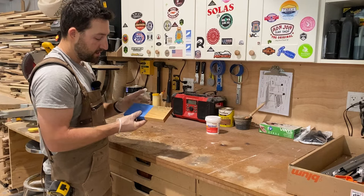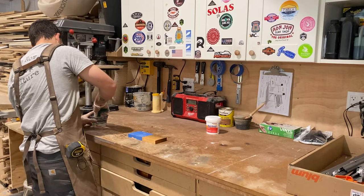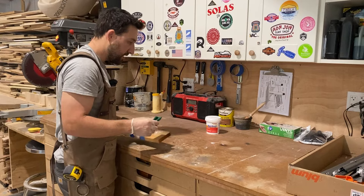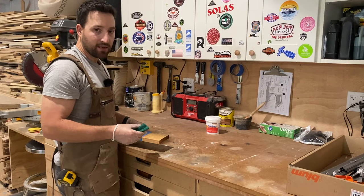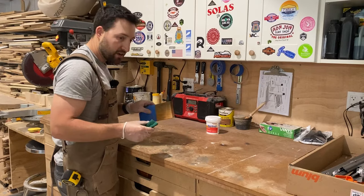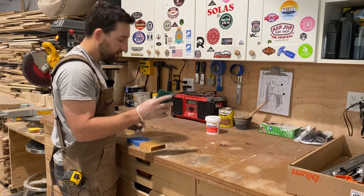You have to wait about 10 minutes for it to soak in, then I'm going to apply it again. I'll pull this tape off when it's all dry and show you just how much of a difference this makes. The amazing thing is this stuff seems to not really affect stains — and I don't mean mineral stains. If you do an oil stain on the wood, it doesn't affect the oil stain at all. Water stain I haven't tried yet, but I'm assuming that might have an effect, so just be careful what you're using this on. This is untreated red oak with an iron mineral stain in it.